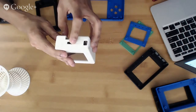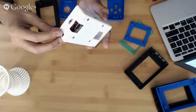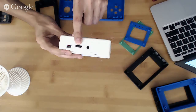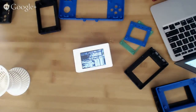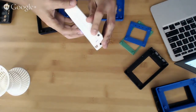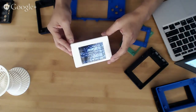On the side, that's where the slide switch is — it just turns on like that. Right here is a nice big port opening for the micro USB — that's the port on the PowerBoost 500C, so you can plug in to charge the battery or power it with a 5-volt supply without using the battery. You could also get another screen — this supports dual screen, which is really great. And of course there's the audio jack right there. The screws are number 4-40 machine screws, which you can get on Amazon. The number one question I always get is where to get machine screws — check out Amazon. We also use number 2s, 4s, and 6s.